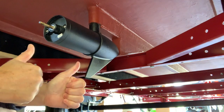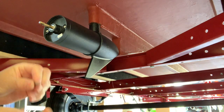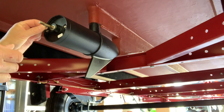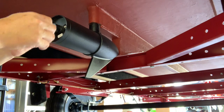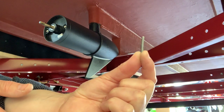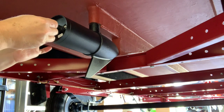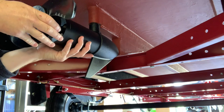That was nice and easy. Let me go grab the propeller. The propeller has a key and just a washer and a nylock. So the key goes right in here. Got a slight bend in the key — see that? So before I put this on, I got the pin straightened out. Just used a pair of vise grips and another set of pliers. So the pin is in.